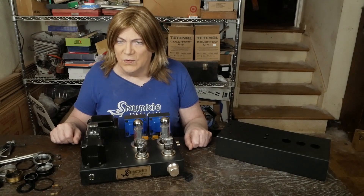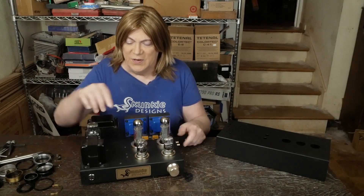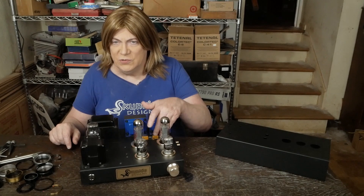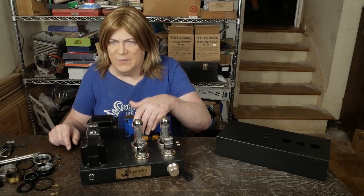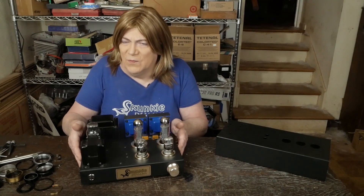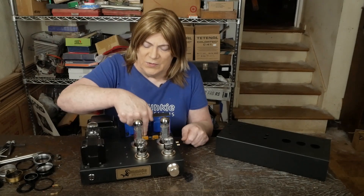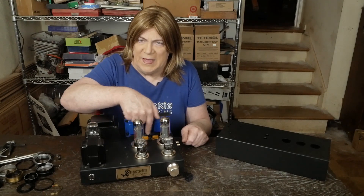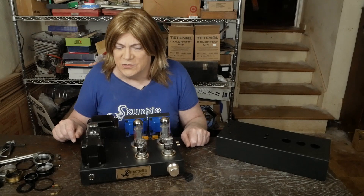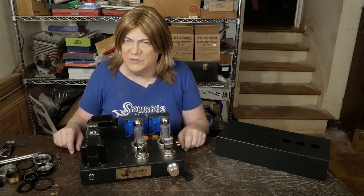On the one I've built, it's not going to have these screws at the top — I've figured out how to do that. The other thing I need to figure out is the cathode resistors. I really like having them top-mounted so heat rejection isn't inside the chassis itself, but I may end up mounting them underneath and putting some ventilation holes in the back, maybe a little screen. These don't get super hot, but they do put out some heat, and heat kills electrolytic caps — and we are going to be using some electrolytic caps.